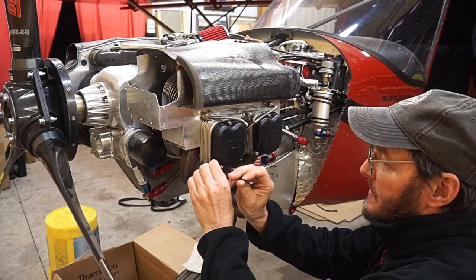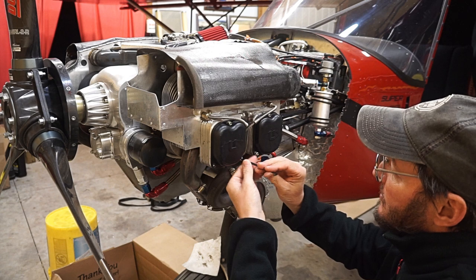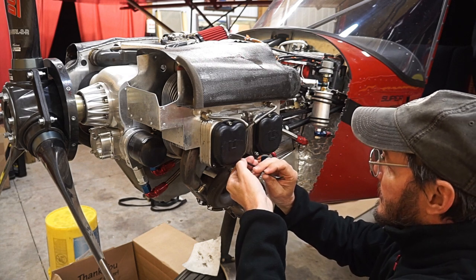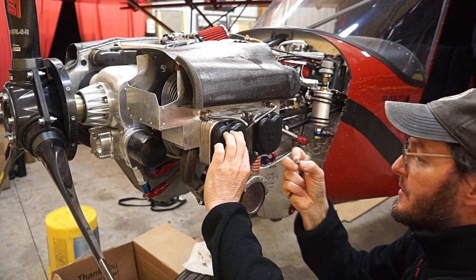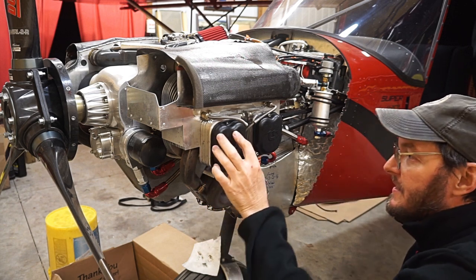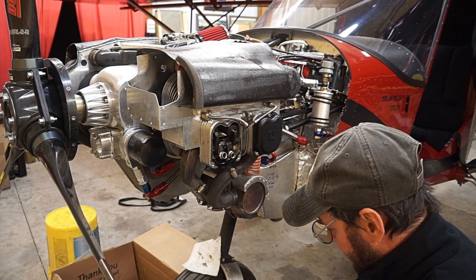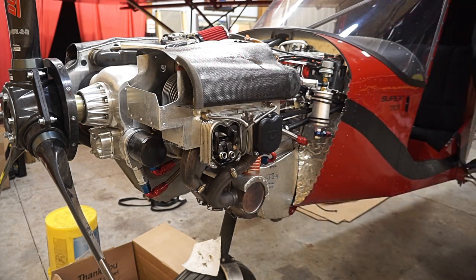What I'm doing here is taking the valve covers off. There are four valve covers on the 350 IS engine — the 350 series all have four cylinders, so four valve covers. All you need to do this is a set of common metric Allen wrenches. Each valve cover has three small Allen-headed bolts and two sides to the Nordlock washer, so there'll be two pieces. Something I should mention: it'll drip a few drops of oil, so have something to catch the oil underneath. It's usually maybe a teaspoon. You've got the rocker arms and the adjustment screws inside — the valves are underneath the rocker arms. It's all a really robust and simple system.